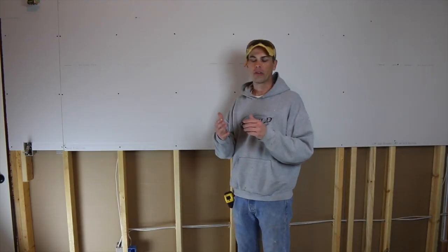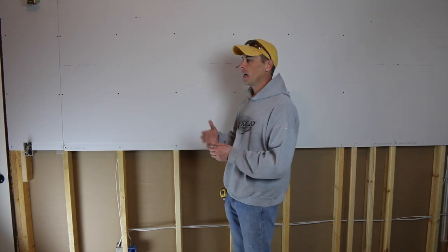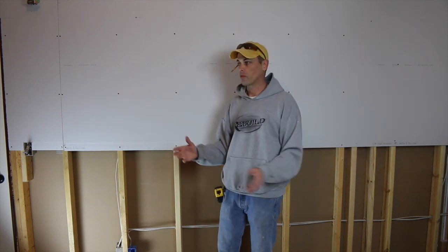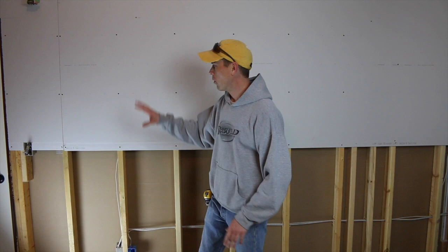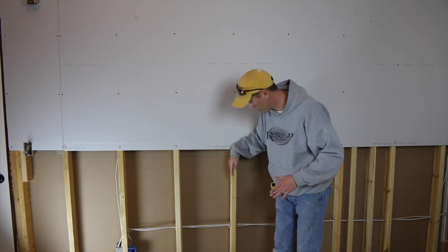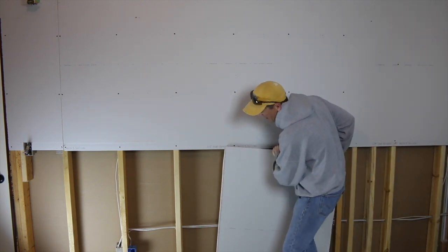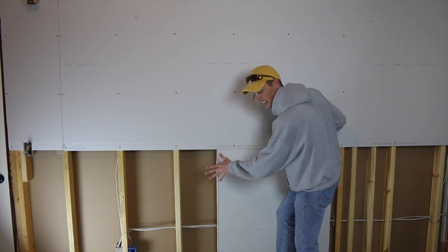First, there are a couple of things we need to know. Sheetrock comes in standard sizes: 4x10, 12, and 14, but in most situations people are dealing with 4x8 sheets. You want to plan that out ahead of time with the size of the room to prevent butt joints. In some situations like this one we have to have them — the room's an odd size, about 16x8 by 17 feet. Whenever we do have a seam, the sheetrock must break on a stud, which means it must go halfway over. It's never okay to break it out without any support behind the wall — if somebody leans against it, it's going to break right there.